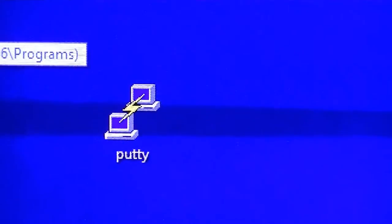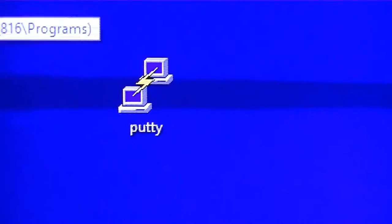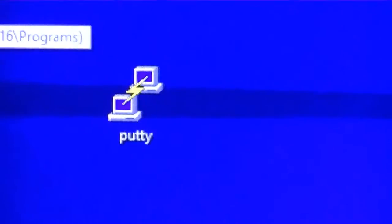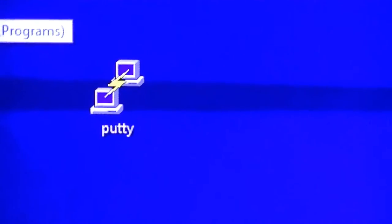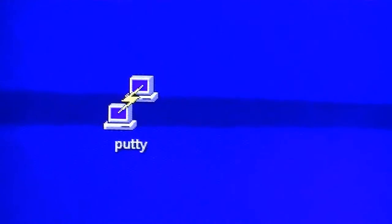Now, in order to get the GPS signal, whether it's Bluetooth or the USB connected device, they emulate a COM port. And the key is you need to know the communication parameters of your GPS, and you need to make sure that it's giving you a proper signal. That was where I stumbled horribly. I'm going to use open source PuTTY to check this.